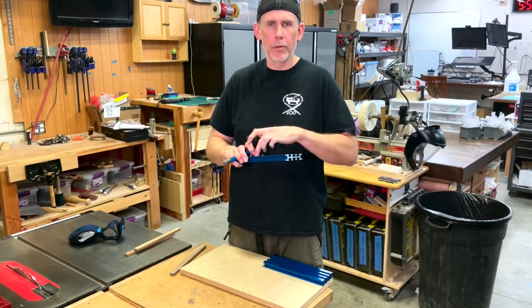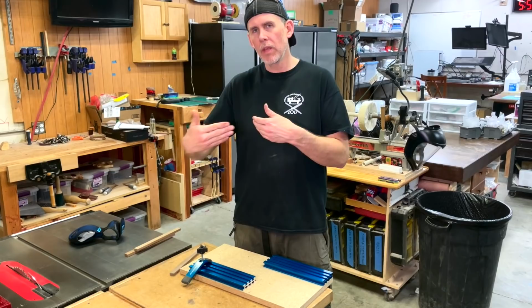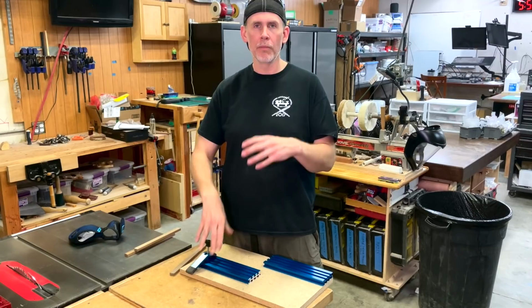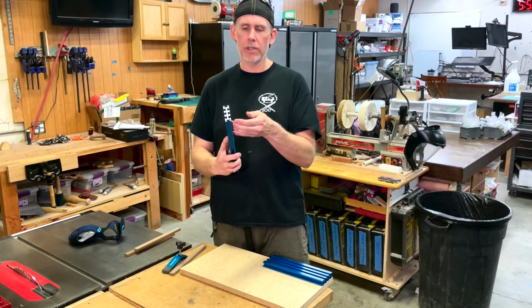So we're going to bolt it together, kind of like for anybody that has a table saw with a miter gauge. If you've ever mounted a wood fence to it, it's going to be the same way, where you're using the T-slot material and a bolt to securely fasten everything down. Much better way. It's going to be super strong and everything will work great. Plus, I don't even have to drill into this stuff or mess around with it. It all works because it's T-track.